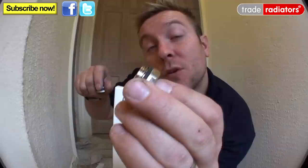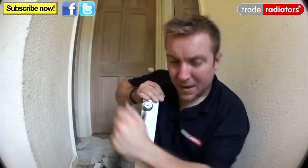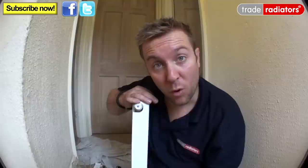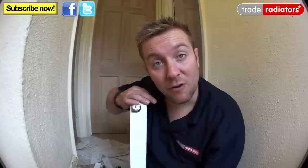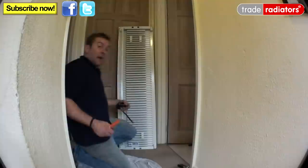Remove the travel plug and pop in your insert. You'll notice there's a rubber washer around there so it shouldn't require any sealant. Give that a quick nip up. Do the same at the other end and pop your air bleed in. It's worth remembering that you should always pop your air bleed at the end of the radiator that you know you'll be able to get at once it's installed on the wall — you don't want it up tight to another wall. Also worth noting, you can take the top grill and side grill off and turn the radiator the other way up to make it a round-top radiator, so it can be converted to two different types.